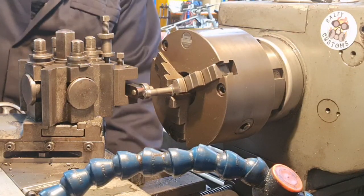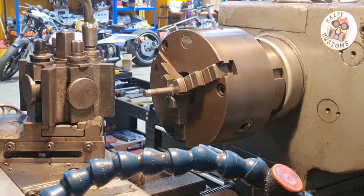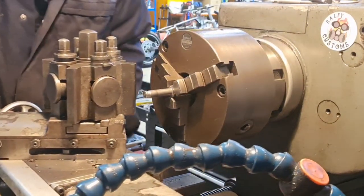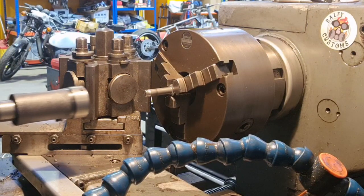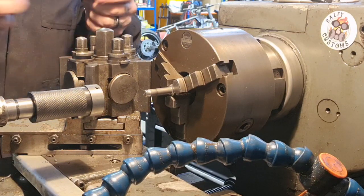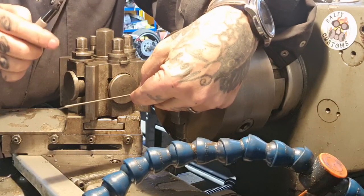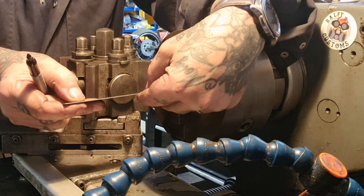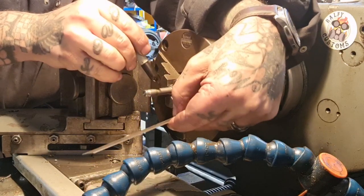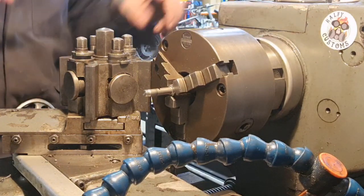We're going to run a die down. That's the plan. So, put that away properly. Don't be lazy. I'm going to run a die down, as I've said. I always struggle with this. I've not given myself a mark either, so let's do that now. So we're inching off long. We want 3/4, which we're going to call 20 millimetres, to where the thread ends, my formula is.